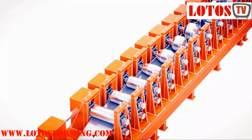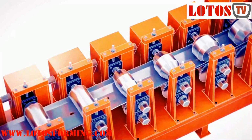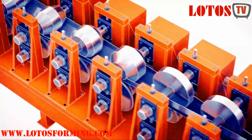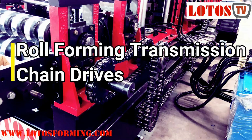Most roll-forming machines use three-phase AC motors. In the low-cost design mills, chains and chain and gear combinations have been used for speed reduction and power transfer. Sometimes, a speed gear reducer is installed between the motor and the mill.